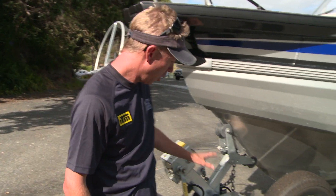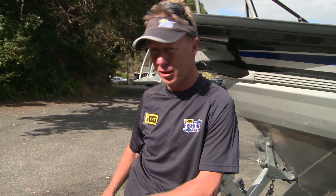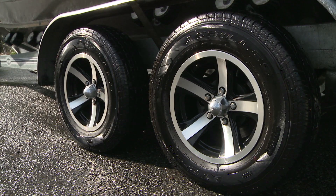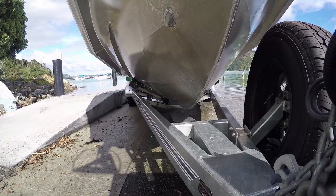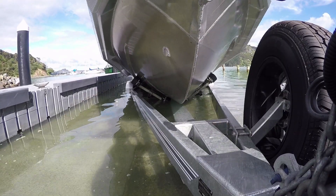I've got the Hydrastar hydraulic braking, which is all controlled by my trailer plug. As soon as I put my foot on the brake, I get nice even braking onto my stainless steel rotors — that's a real treat. I can just pull up to the ramp and back straight in. This is the third boat I've insisted on those stainless steel rotors from Kodiak.